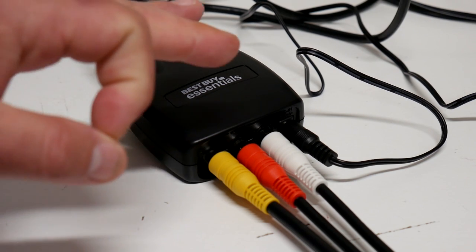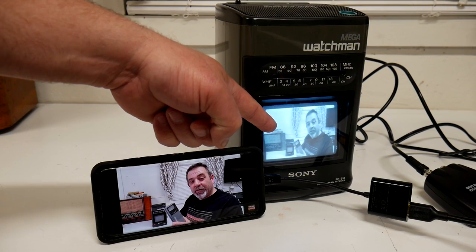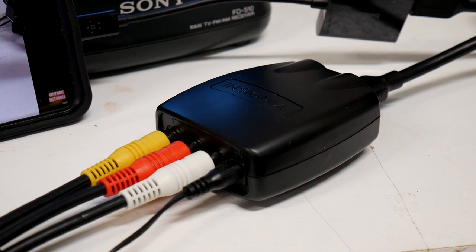But let's say your source is a device that uses USB-C or HDMI and you want to send it to a device that uses RF. How do we get this to work? Well, there's a device for that too, and that device is an HDMI to composite video converter. It takes HDMI video on one end and brings it out as composite video on the other. This has a couple of different uses — if you have an HDMI signal that you want to input to a CRT television that has composite video inputs, you could use this and go straight into it. In my case, I double it up with the RF modulator in order to get it to older TVs that do not have video inputs. So in the case of the Mega Watchman playing videos from my phone, we're actually double-converting that video: taking it from HD over HDMI, converting that into composite video, and then converting that into an RF signal to feed into the back of the TV.